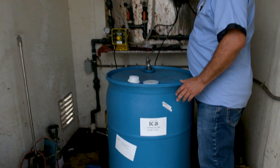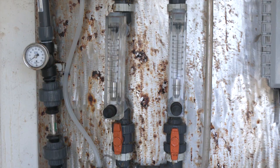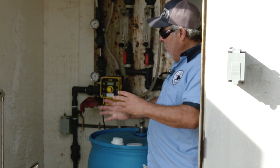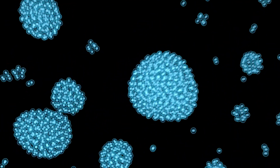The first step is we inject polymer and water, which in turn mixes with the microorganisms. The polymer is either positively charged or negatively charged, which in turn makes the microorganisms coagulate and gets rid of the water.